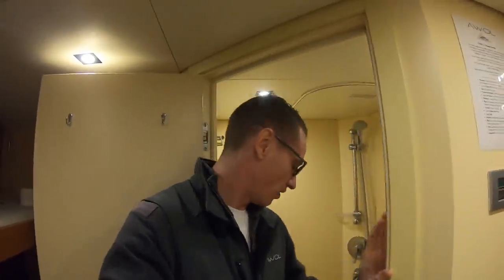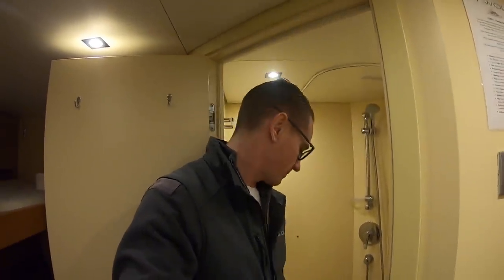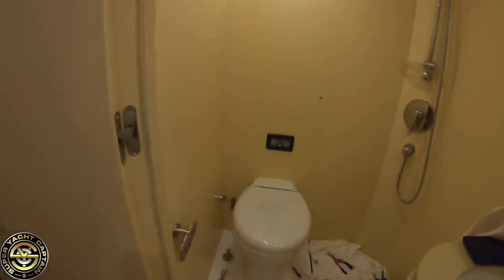Welcome back to the channel and the vlog. My name is Tristan Mortlock and this is Captain's Vlog. Today's video isn't very elegant — we're currently in the chef's and engineer's cabin. There's an issue with the toilet: it's not flushing correctly. The water is going down but it doesn't feel or sound right. Slavin is going to get tools from the engine room. We have to take the toilet off — inside there's an electric motor with an impeller, and we think something is caught around the impeller.